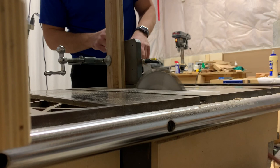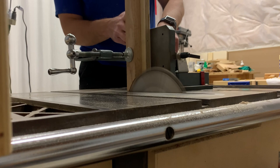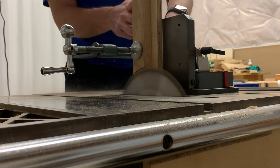Next, I started to cut the tenon for the handle. This tenon is going to be way longer than my table saw can cut with my tenoning jig, so I decided to do it in two stages as well. The first would be to get it sized appropriately with a clean cut that can show out the top of the mallet. We'll come back later for the second stage.